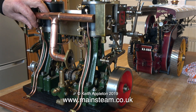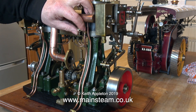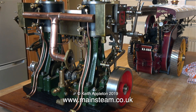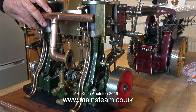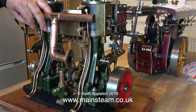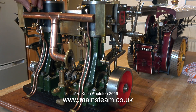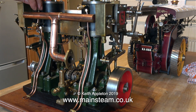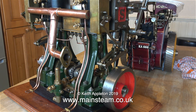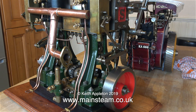Back to this wonderful twin cylinder 5A — these are the drain cocks fitted to it, and they're just normal steam blower taps. You may have noticed that when I opened the taps, quite a lot of water came out of the pipes. Where did the water come from? Obviously it's a steam engine, but it didn't come from steam — after I ran this engine on steam I blew it through with compressed air, WD-40, and steam oil, so when my friend picked it up it was completely dry. I can only think the water came from his compressor.